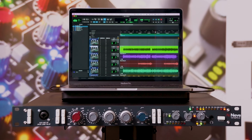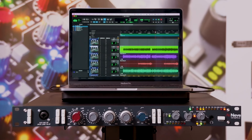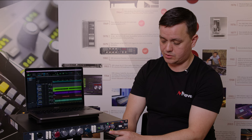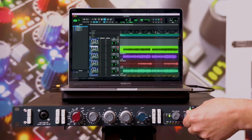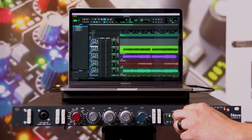When both are engaged you'll see the Blend indicator lit, meaning the blend pot is now active in the circuit. This is your latency-free monitor mode — ideal for overdubs. The pot blends between the direct SPX signal and the stereo DAW signal. It's a detented pot, so in the center both signals are attenuated by around 6 dB. Turn toward SPX for more of your vocal or guitar; turn toward DAW for more of your Pro Tools session feed.